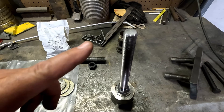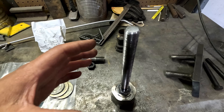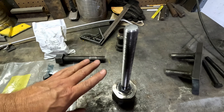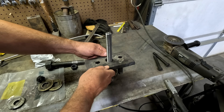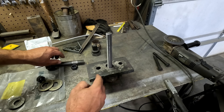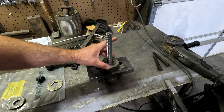It's fixed. On the other one I made it so you could use a wrench to tighten it down. I'm not going to do that — I'm just going to put a double nut on here so I can keep the length that I have. This is pre-combustion chamber puller 2.0, and I'm not going to wobble out the hole on the inside because I'm using a smaller all-thread. That was a problem before as those threads got into the side of it.